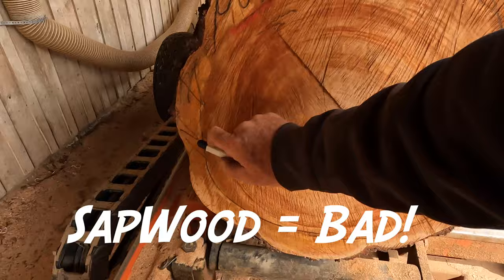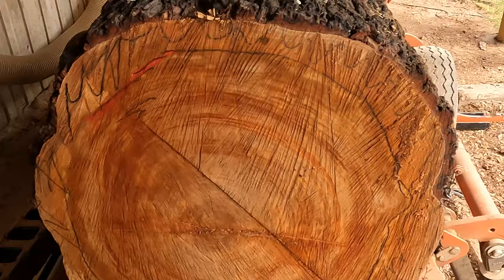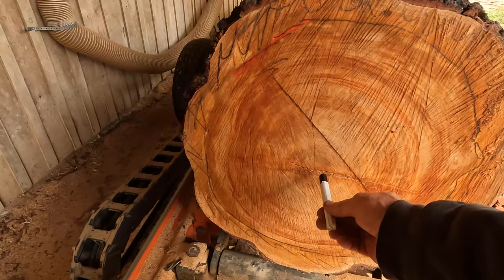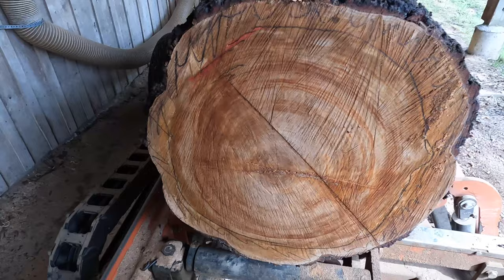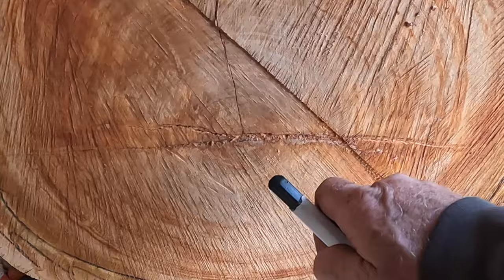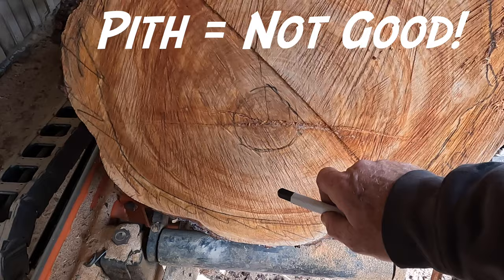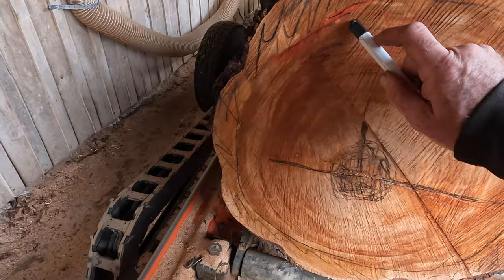So all this is useless. Not only is it useless wood in a cherry log, it actually degrades your final lumber. Now let's look on the inside. This is the axis of the log where the center is. Right here you can see this slightly darkened ring - normally that's called the pith or juvenile wood. This wood is of a different structure than the surrounding wood; it's weaker, it will dry at a different rate, it's not good in cherry. So this gets discarded. You're left with this much - this is what you're going to saw.